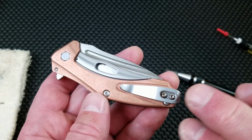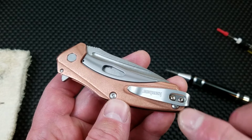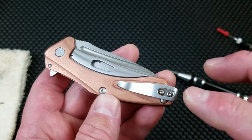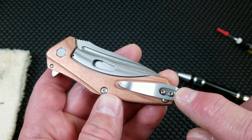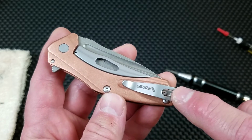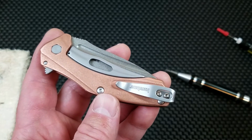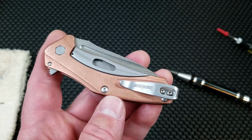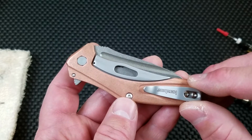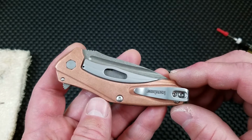The second is you're going to have to change the milling pattern on the inside of this lock side scale to leave a locating pin somewhere at the tail end of that lock bar insert. If you leave a locating pin down at the tail end, then it will locate it, and then you'll have the 2 mounting screws. Then you will have your 2 points of location, and it will keep that from moving laterally like this. That is what they're really going to have to do, and that would just be a change in the machining programming for that scale. And it's all set up CNC anyway, so it should not be a big issue to fix. In fact, they could very well be already aware of it and be moving on it now.